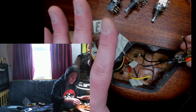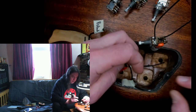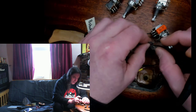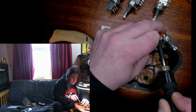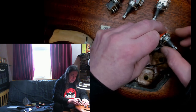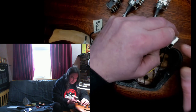Phasing — I don't need to touch it again, so I'm going for it that way. I'm doing some of this outside and some inside the body. So this is the start wire — which might not technically be the correct term — this is the one that goes to earth, and when the button's in, this gets pushed to earth. As I always say, put solder on the wire and put solder on the contact before you try and attach the two together. I've already put solder on these bits when I cut them to length, so we should be all right.